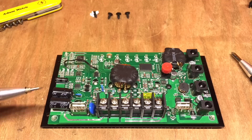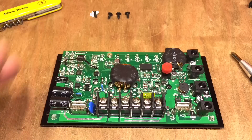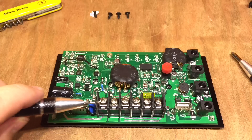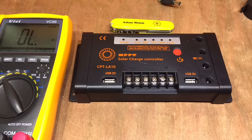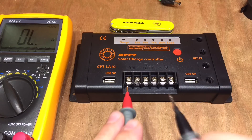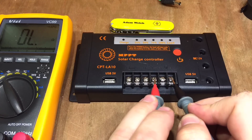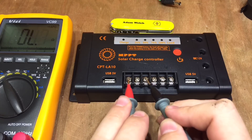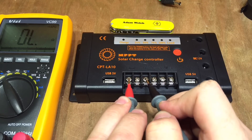As I put this back together, I've noticed these capacitors are rated at 63 volts and they do seem to be connected to the positive connection on the solar panel side. That's interesting, because the auction listing said you could put up to 100 volts of solar panels into this charge controller — I'd be a little bit wary of that with those capacitors only rated at 63 volts. With the case back on, I need to find out if it's common negative or common positive. It doesn't seem to be either — there's a common positive between the battery positive and the load positive, but not between the solar panel and the battery.